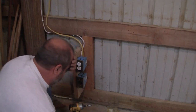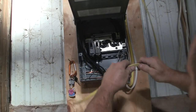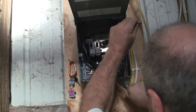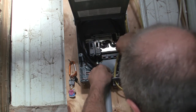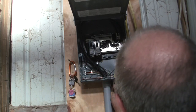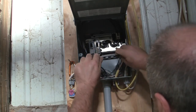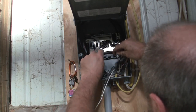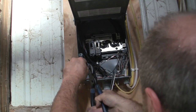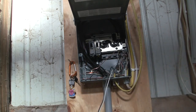All right, so I need to get this all tacked up, but we're going to do that after we get the other side hooked up. All right, so I've already got the wire measured out. Get it pulled up through here. Give me enough room to get nailed. Pull that off. Now, the big difference: the only thing we're putting on the grounding bar will be the ground. So let me kind of shorten that up a little bit. I need a screwdriver. Forgot me a screwdriver.